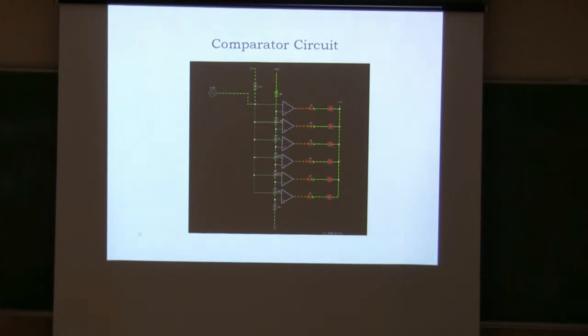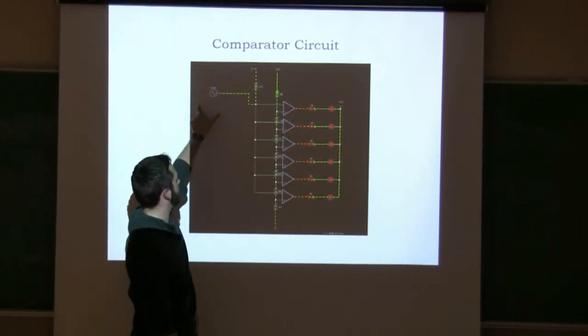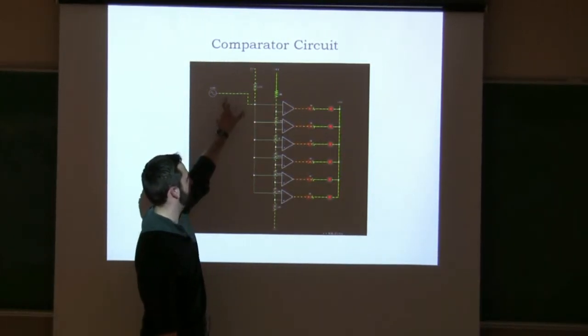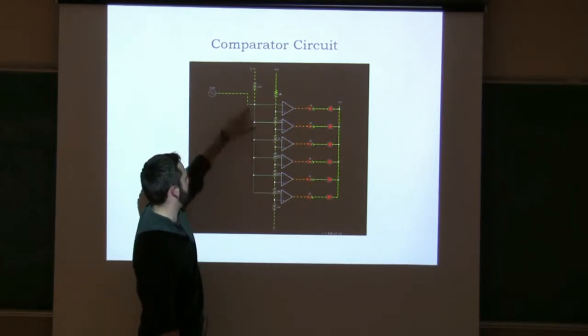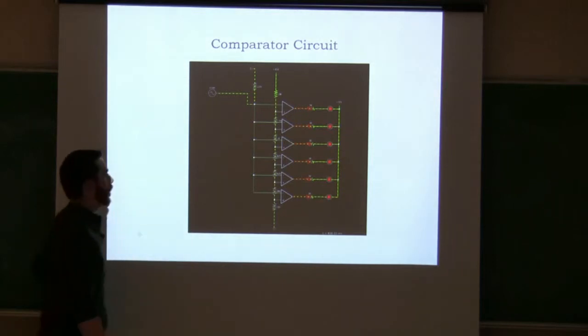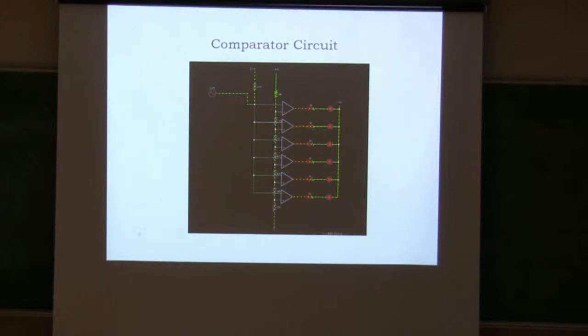It's actually a really simple circuit - it wasn't too bad to get it set up and working. I did a lot of different prototypes, swapping out resistor values, because in the guitar this is a really little input signal. So I actually used a separate chain as just a non-inverting amplifier to get the actual incoming voltage a little bigger, so that the gaps in my comparator levels don't have to be so small.